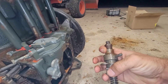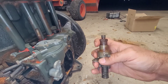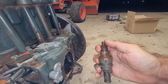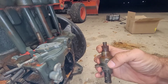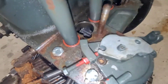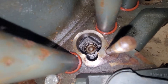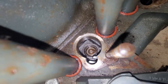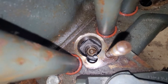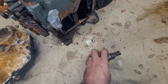You can see this moves. That spring is tapped by the cam on the inside of the motor, and when it pushes up, it squeezes high-pressure fuel out the top — that's where the fuel comes in. Looking in here, you can see that's the little tappet, and then you'll see the rail coming back and forth. That little notch is where the tab on the injection pump goes in.